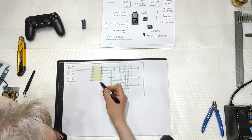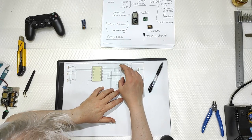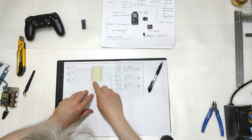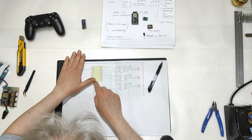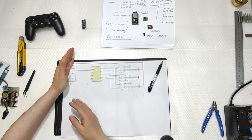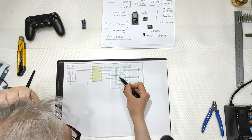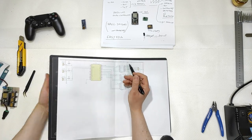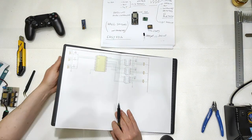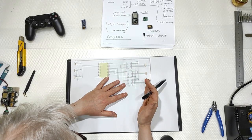Then I connected everything. From the right side of the stepper drivers, I've connected the motors. The left side is connected to the brain, and the left side of the ESP32 is connected to the hall sensors that I will not use right now, but you don't know, let's get them in place for the future. From this side I just have 1, 2, 3, 4, 5, 1, 2, 3, 4, 5, 1, 2, 3, 4, 5, and they are symmetrical. So if I use pins 1, 2, 3 there and 7 and 8, I will use the same pins for the three motors, because they need the same kind of input for clockwise, counterclockwise, and the number of steps they need to take.